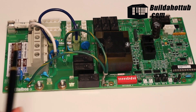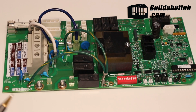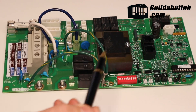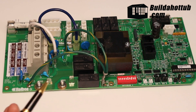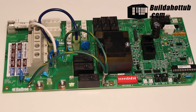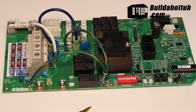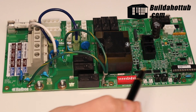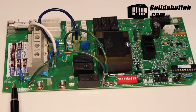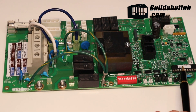When looking for a replacement circuit board, I need to check that it's visually very similar. There may be some small changes as different revisions have come in, but in general the appearance should be very similar. The most important thing on a Balboa circuit board is taking a look at the chip revision and the chip model that is actually in it.